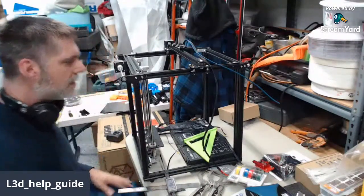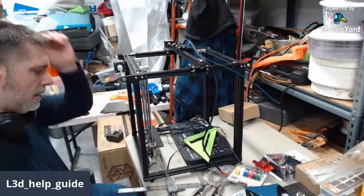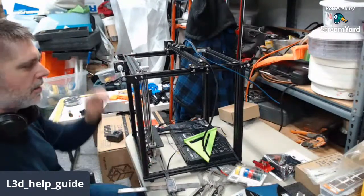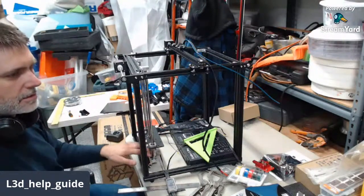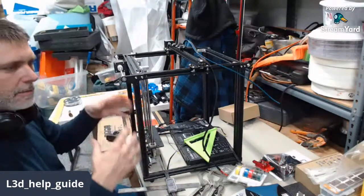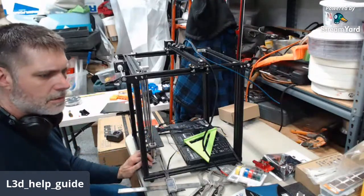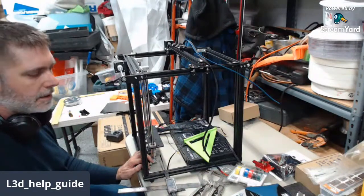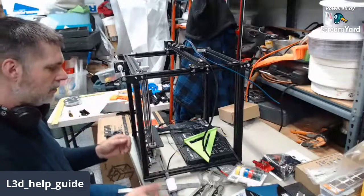The way that we're going to adjust it is there's a pillow block here and a pillow block down here. I'm going to loosen one and then adjust. I'll loosen this one a little bit, totally loosen the other one, adjust it to the size, get it settled in, then I'll remeasure it. Even though 0.28 is not very much, we're probably shooting for less than 0.08 if I can measure it that accurately from top to bottom. That would be a good goal.